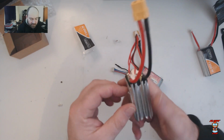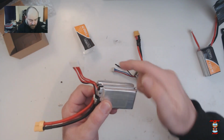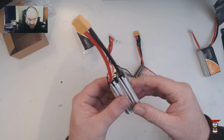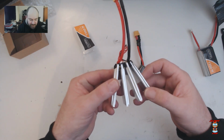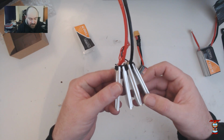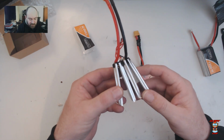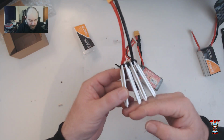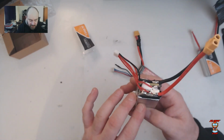Okay, but in terms of the internal construction of the battery, same thing. Single piece of sellotape going across all 4 cells to hold them together. Another difference is they're not glued. They don't have double-sided tape in between them, unlike the Fleurions, which are stuck together, which makes a much more rigid pack, and it just helps to absorb impacts a little bit better. So no aluminum plates, no gluing between the cells, no padding on the back or the front, but other than that, the rest of the construction is pretty much the same.